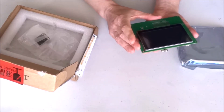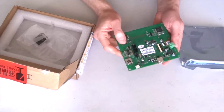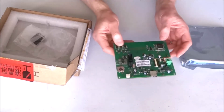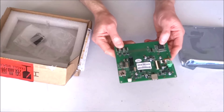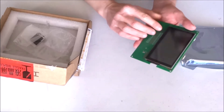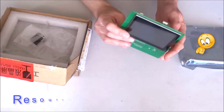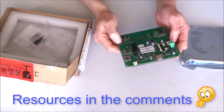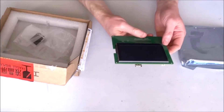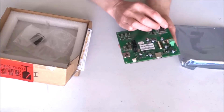This display has built-in Wi-Fi among other things. This development board has a microphone, it has Wi-Fi, and the microSD we already understand. I would expect this larger chip to be the main smart controller that handles video rendering and high-level graphical primitives. At minimum we have a microphone and Wi-Fi. There also appears to be a battery connector, so I wouldn't be surprised if it even has battery management.